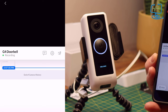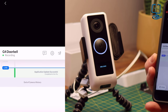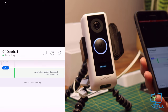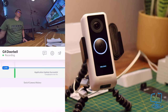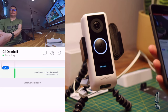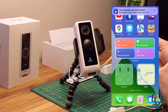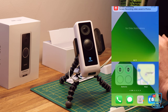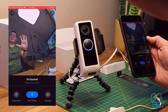The update has now finished and we have a welcome screen on the little display under the doorbell button. After backing out and going back into the app to refresh, it's now recording. You can see a nice clear picture. If I push the doorbell button, we get a prompt on screen that someone is ringing at the UniFi G4 Doorbell. The front screen flashes 'Ringing' and the phone makes a ringing notification. I've gone to pick up on the alert and can now talk to the person at the door.